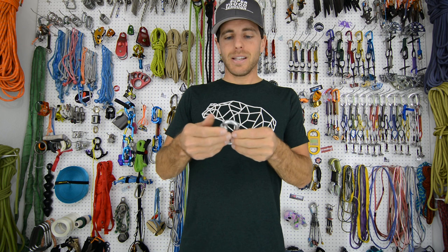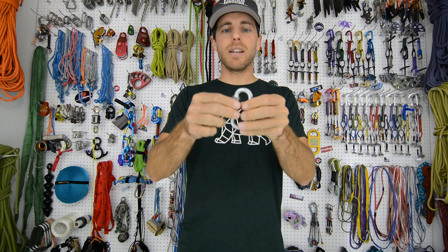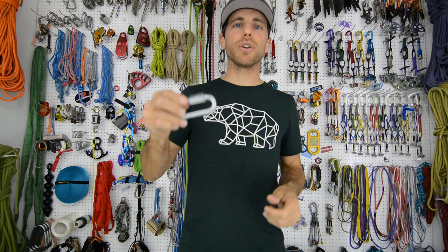However, why is it super strong being pulled this way? I don't actually think it's rated for breaking at 10 kilonewtons. I think once it hits 10 kilonewtons you're not un-nutting it — the nut will bend so much that you're not going to be able to use your product anymore. And I think that's why it's rated all the same. The 7mm quick links did start to deform a little bit before 10 kilonewtons. I also wonder if they struggled to test these cross-loaded when they standardized the tests, because it's really hard with the nut in the way — as soon as it starts to bend it wants to twist.